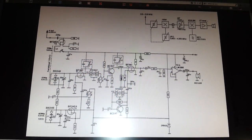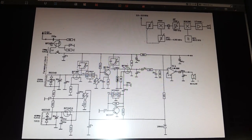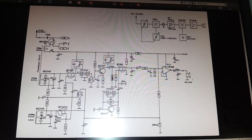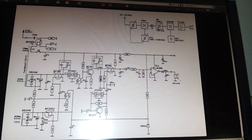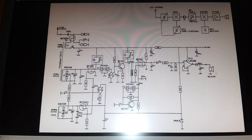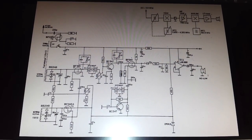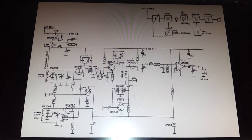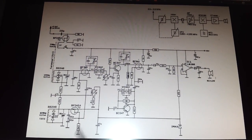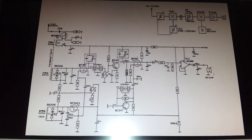As you can see there are two mixers. The first one is for intermediate frequency and the second one is for audio frequency. So it is a superhet with one intermediate frequency, and there are used filters at 455 kHz.